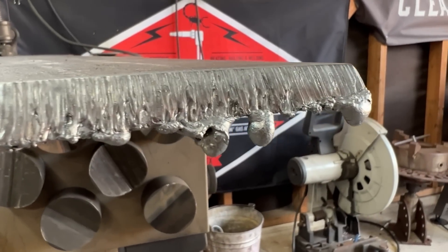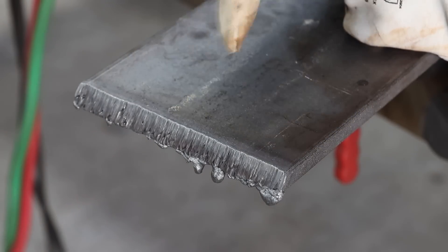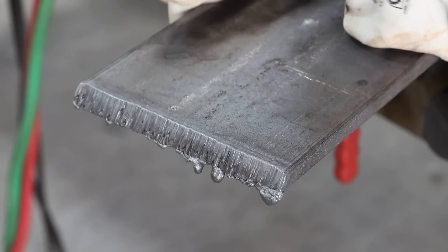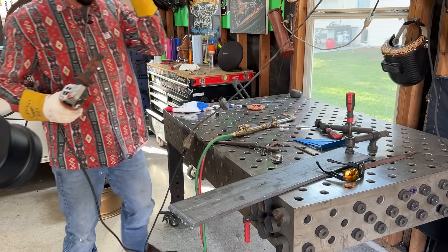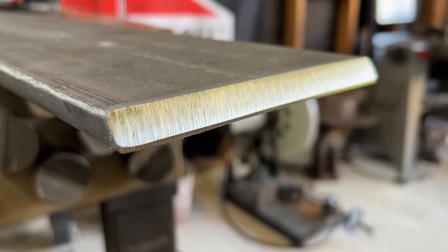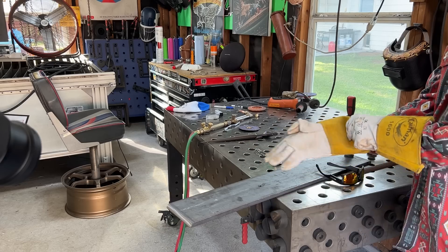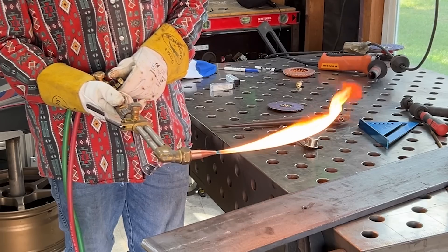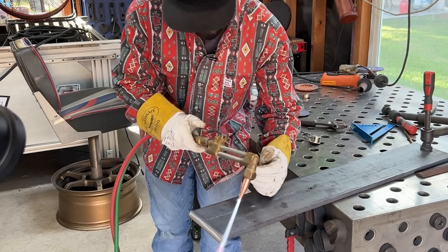This is one reason I've always used propane in my shop — at half-inch thick it still gets the job done. There are some bumps I didn't have before, but I think that's more my fault. What I did notice is that with propane and propylene, when cutting thicker metal at angles, the cut lags behind and doesn't come out as smooth — it has little grooves and divots, like it wants to bounce out of the cut. We can still clean it up quickly with the fiber disc and get a nice bevel on there.